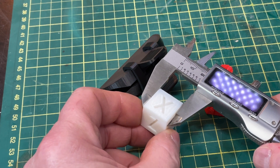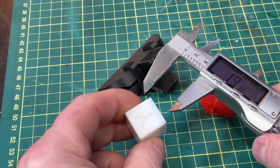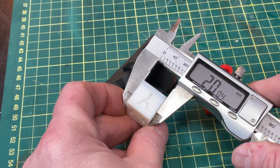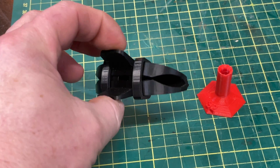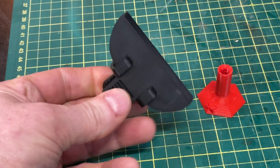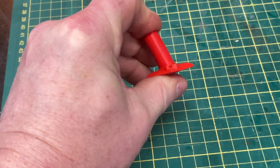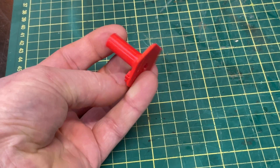I wanted to try some different materials. I printed a 20 by 20 millimeter calibration cube — on the X axis it's within 0.04 millimeters, and on the Y axis it's about 0.02 to 0.03 millimeters over 20, so very close. The black bag clip is ABS — the worst material I have — and the red golf tee is TPU, which is flexible. The K1 Max did a fantastic job on all of these strange materials and I look forward to trying more.